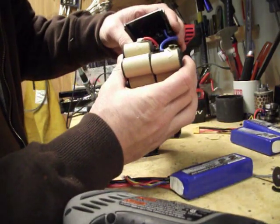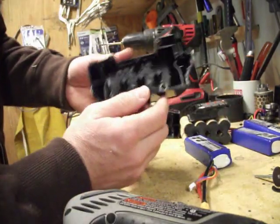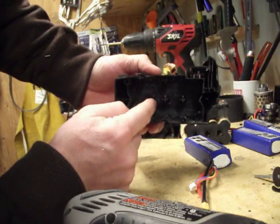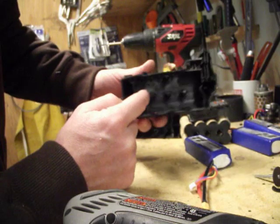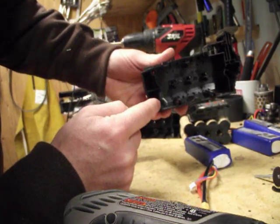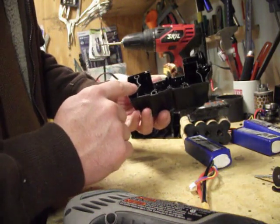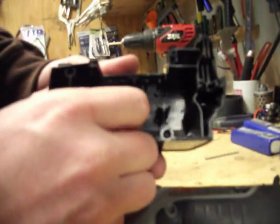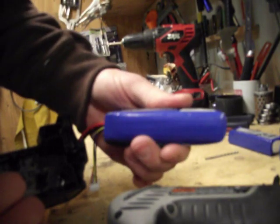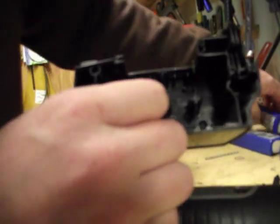All I've got to do is cut those wires off and solder the new ones on. This cavity has posts for keeping the batteries from banging around, but I've got to dremel all that stuff out. I also have to dremel the front out because I need all the space I can get to fit these batteries in. I want plenty of room because sometimes lithium polymer packs get old and kind of turn into balloons — they puff up a little bit.